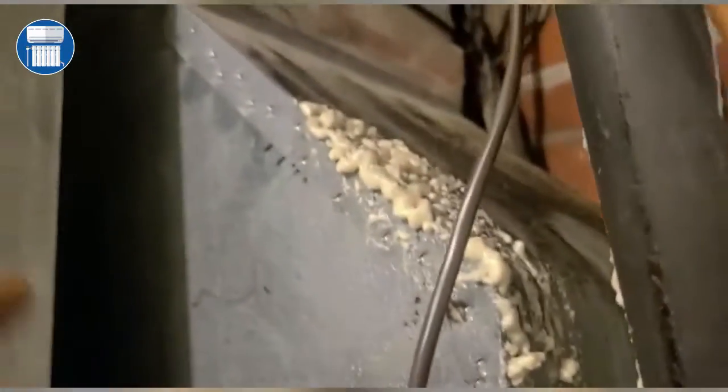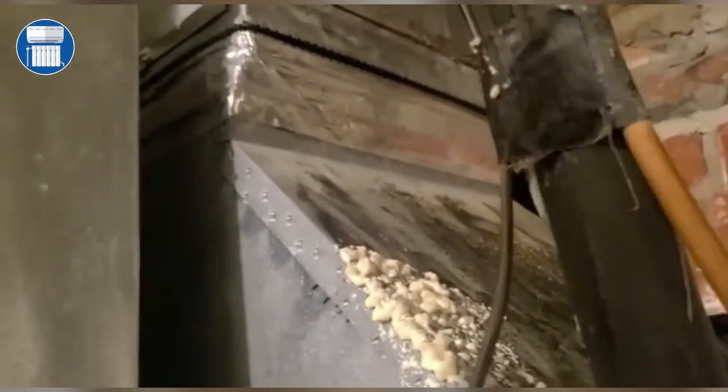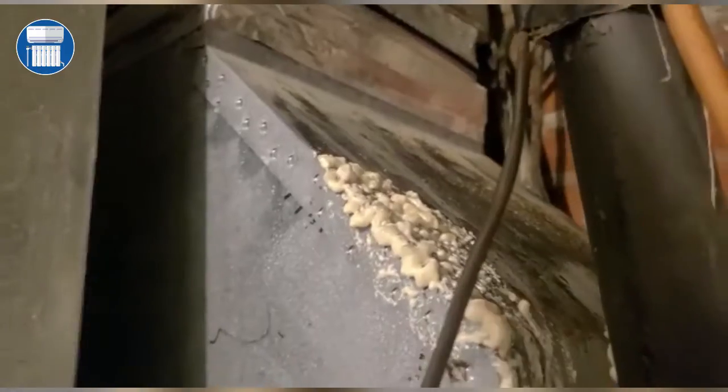They didn't use any slips or drives. So what was happening is, as you can see, the unit was sweating. I think I have water. All over the floor there is water, because the whole duct, when it was on, it was sweating. If you look at my hands, you can see there is water in my hands because the duct is sweating. The reason why the duct is sweating is because you're mixing hot air with the cool air.